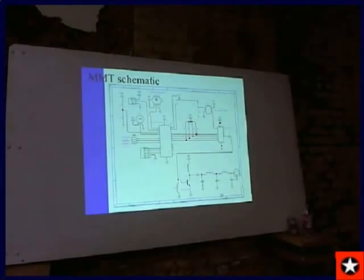And on VHF, I just modulate it, feed an audio signal into this, and it does modulation directly. It's direct FM. And it cuts down on a lot of complexity of the circuitry. That clock synthesizer is also made by Cypress, who also makes the PSoC. And that synthesizer chip puts out about 20 milliwatts all by itself. I've actually flown this many times on the VHF bands on 2 meters with just 20 milliwatts. And with a good antenna, you can get great signals on that.